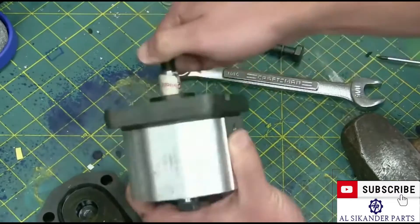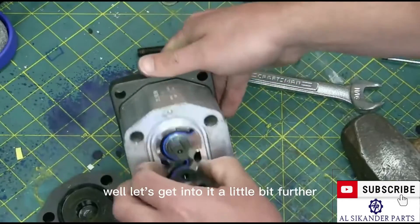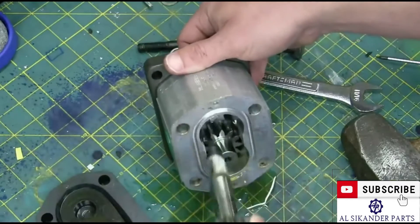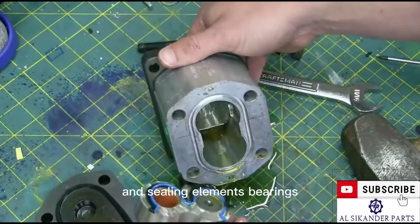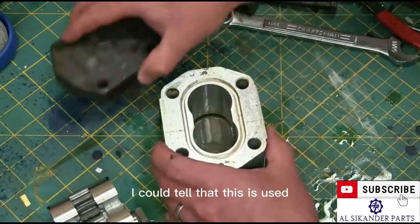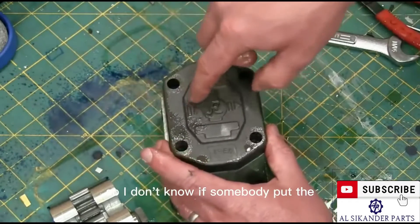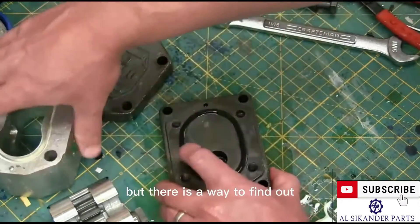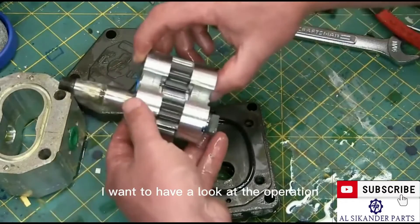As you can see, the input shaft makes another shaft counter-rotate. It's been used — it's got hydraulic fluid in it. There's the cavity, sealing elements, bearings. Now we've got our A-part. I can tell this is used on account of the kind of nasty oil in there. I don't know if somebody put the backing plate on incorrectly or if it indeed is a motor, but there is a way to find out. We check this seal here — I'll explain that momentarily.